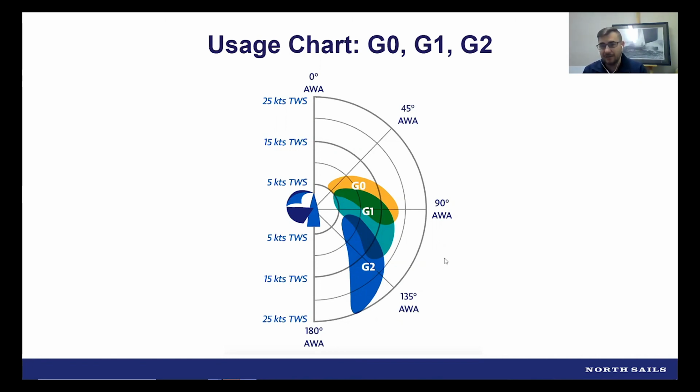The other side of this story is if you're a double-handed cruiser and you've got a top-down furler, you can furl the sail, jibe the boat and unfurl. If you've got a spinnaker snuffer, you can snuff the sail, jibe the boat and redeploy. So there are a few different ways to go about it. The main thing is doing it in a way that matches the amount of physical output you want to put in, and the safety factor, and the breeze and conditions you're in. If you're in a big sea, it may be a really good idea to snuff that sail or furl that sail and just focus on getting your mainsail across. Yeah, we call that the AARP jibe. Just take our time, jibe over, roll it out, all good.